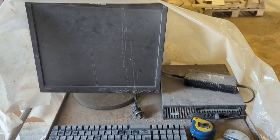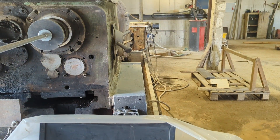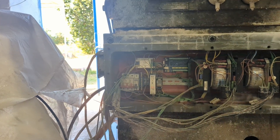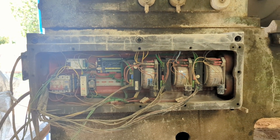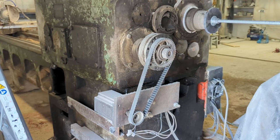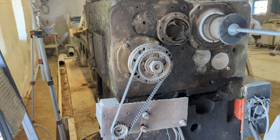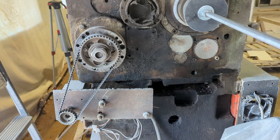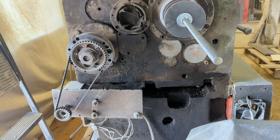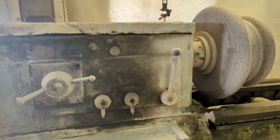First, as you can see, it works. Everything starts with this old computer which controls these drivers, which I placed in the former machine feed box. Drivers control three stepper motors. First, most powerful, which has 21 Nm of torque, is responsible for the A axis, which is the rotary axis of the machine. The transmission of torque to the spindle occurs by means of the gearbox of the machine, which I managed to restore.